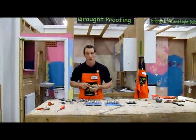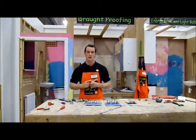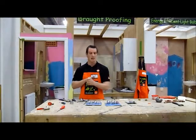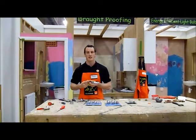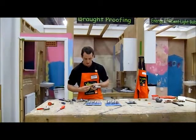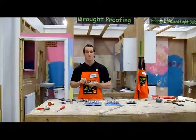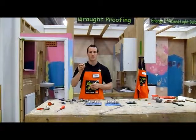Now, it does have a rubber O-ring on it here, so again, if it's leaking out of the top here, chances are it's that O-ring. If it is leaking out of the spout, it's quite possible a bit of grit has gotten in between the two ceramic parts here, or sometimes there is a little washer here that can degrade. But generally it's just a little bit of grit getting in here, so you can just clear that out once you have the valve out.